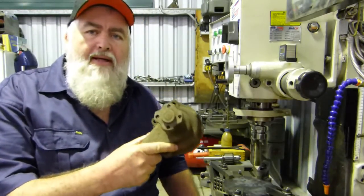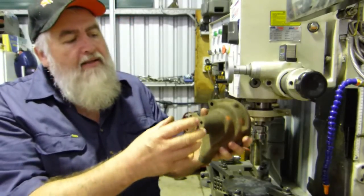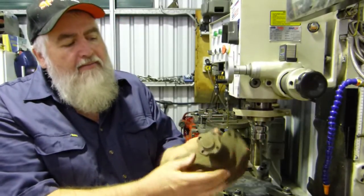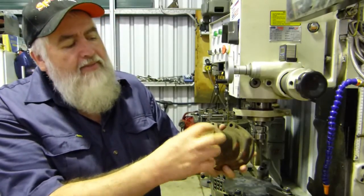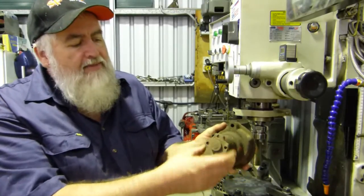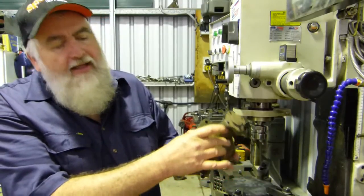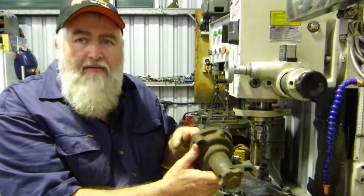here's a water pump here, and this is off a little Allis-Chalmers Model B, and the pulley sits over here. But to put a kit into this pump, you need to pick up these four bolts and pull this off. It comes out. Sometimes there's a retaining clip in underneath there, and then you usually press from the impeller forward.